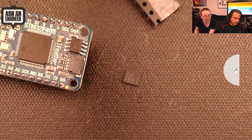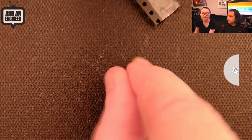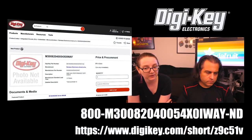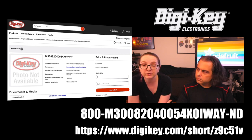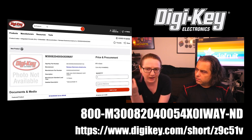One megabyte is quite a bit of storage. In Discord, Scott's talking about the different CircuitPython boards because of the CubeSat folks. Max Holliday from Stanford was the one who did that — we had him on the show not too long ago. He pointed out that the SAMD51 chip with CircuitPython support can boot from an external QSPI flash memory. One of their problems is flash memory getting corrupted in space, so if the program could live in this radiation-non-susceptible MRAM and run from that, that would be ideal.